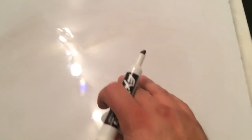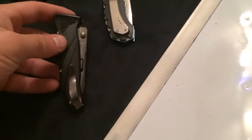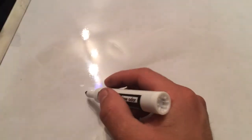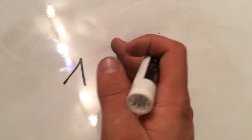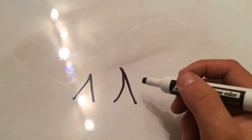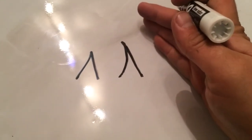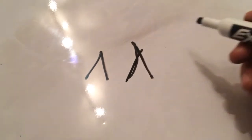If you saw my last video, I went from 2000 grit sandpaper to a ceramic stone back to 2000 grit sandpaper. First, I used the 2000 grit sandpaper to get rid of some of the rolls and deviations I had in the edge. And when I mean deviations, for example, say a V-ground edge should look like this, at the very edge, that is. Now, under use, the edge will kind of sway back and forth. If it chips, that's a different story. Then you gotta resharpen. But if it rolls, or if it deviates, or if it starts losing sharpness, your edge might do a little something like this, where you can see slightly it's pushed to one side. So what you would want to do is strop or something, and realign that edge to be a V-grind.